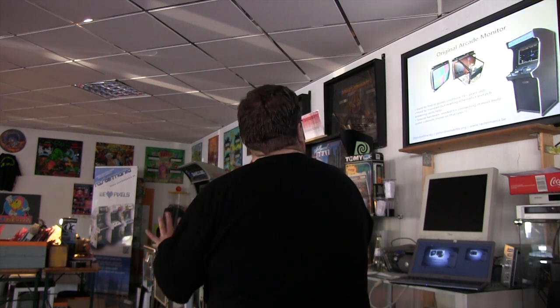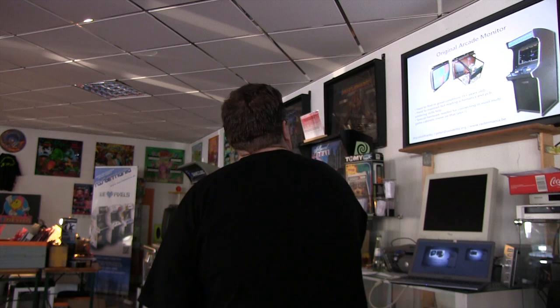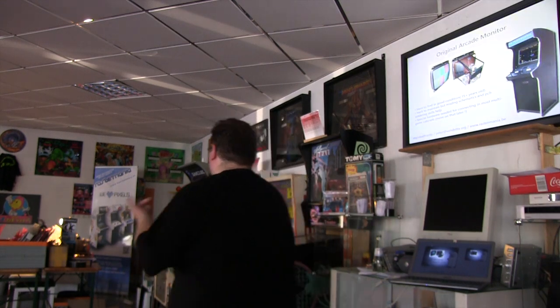They are repairable, although some parts like flybacks and some other signal generator transistors are getting hard to find, and we would have to take three monitor PCBs and put them together to make one working one. Also, the hours that the tube can work is limited, and once your tube reaches, say, 100,000 hours, it will go dark and stop working.